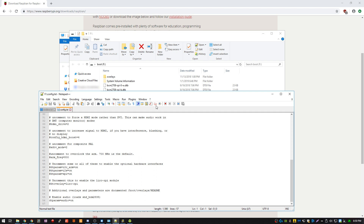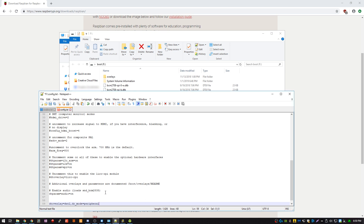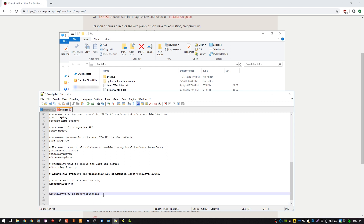Next is config.txt. For this one we can just add it down a couple lines and it has to be exactly this — again copying and pasting. All of this will be in the description as always. On the Raspberry Pi Zero we don't need this part because it is OTG. However because the Raspberry Pi A Plus is not OTG, we have to specify and tell it that it is going to act as a peripheral. So we're going to put the dual role mode as peripheral. Let's hit save on that one.